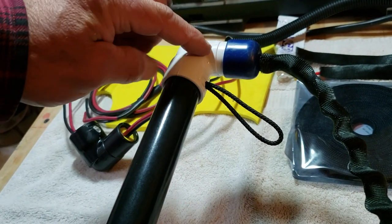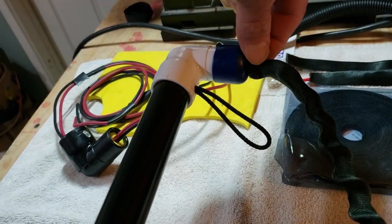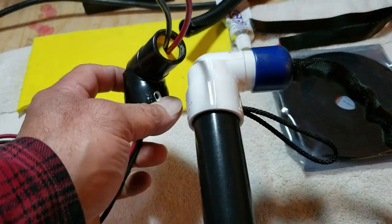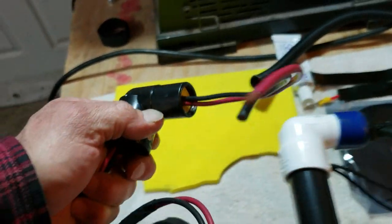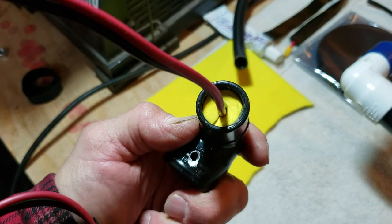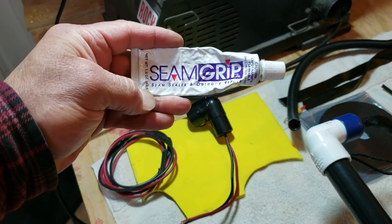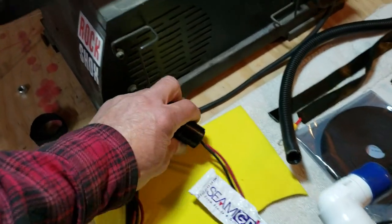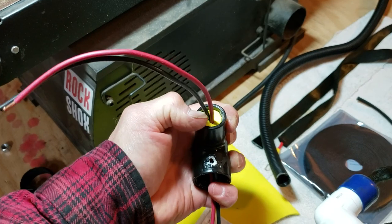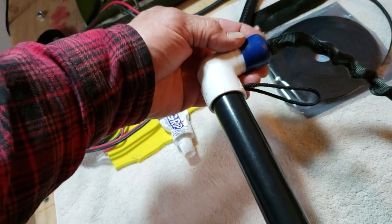I got rid of that bracket, and while I had this apart I decided to waterproof the opening where the red and black wires come out. I took a piece of yellow foam, cut a plug, shoved it down in there, and then filled that cup I created with seam grip — an outdoor sealant for fixing tents and hiking boots. You could probably use silicone or anything similar. The foam keeps the sealant from running down into the motor shaft. Once that was dry, I added a rubber cap that I happened to have, cut a hole in the end, shoved it on, and glued it on.